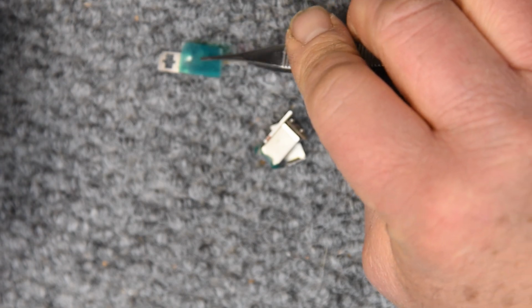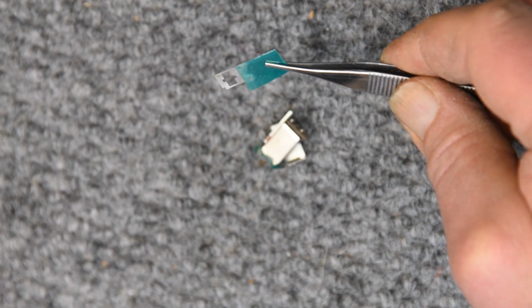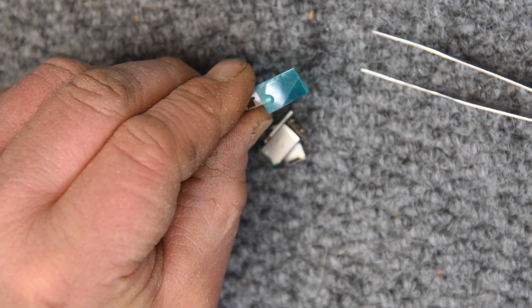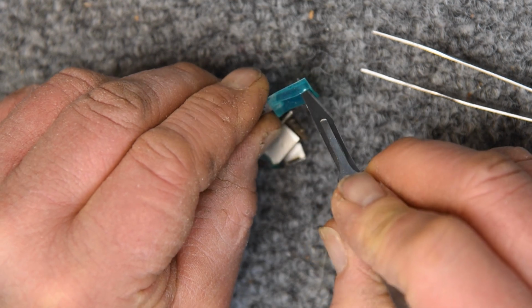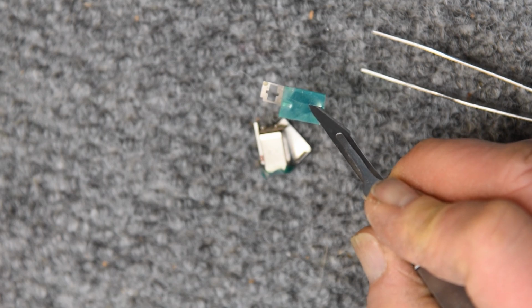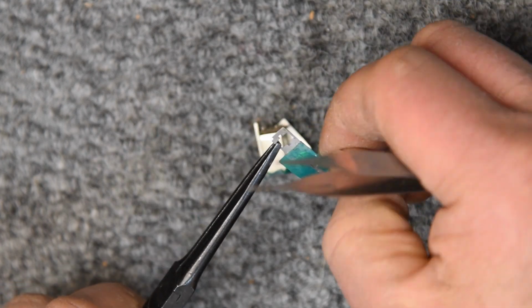So this is bead blasted and then not touched, or touched very little, if it can be helped. This is a very low pressure bead blast. Thin materials like this will just collapse in a high pressure bead blast. So this is low pressure and very little work done. I'm just trying to keep these surfaces clean.